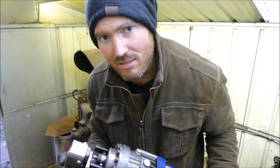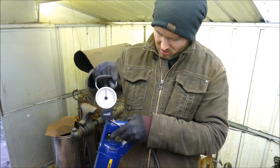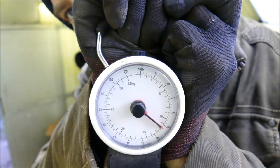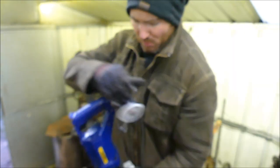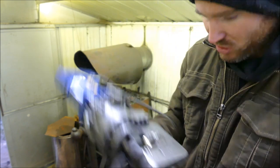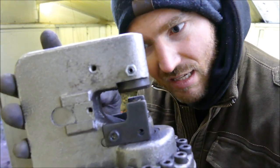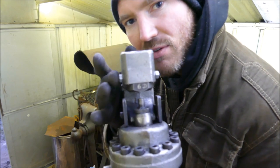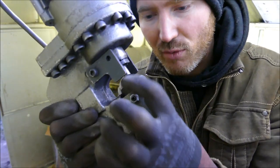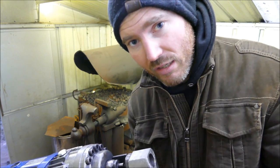It says the maximum you can cut is 6mm, but I've been cutting 8mm as I'll show you. Weight-wise, it's about 12 kilos. Key features include an adjustable backstop. As for punching space: from the center of the punch to the inside is 40mm, from center to the very outside is 30mm, and from the face backwards is 17mm — that's the minimum you can do.